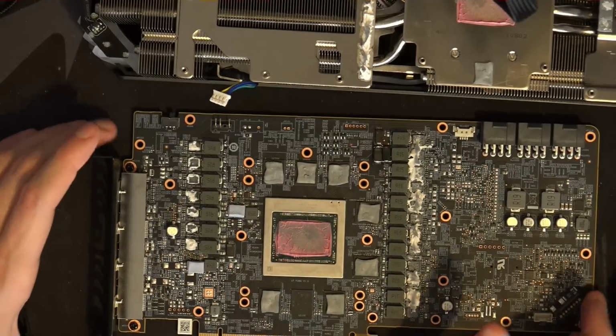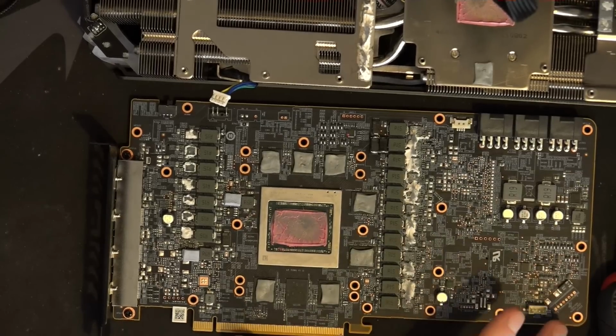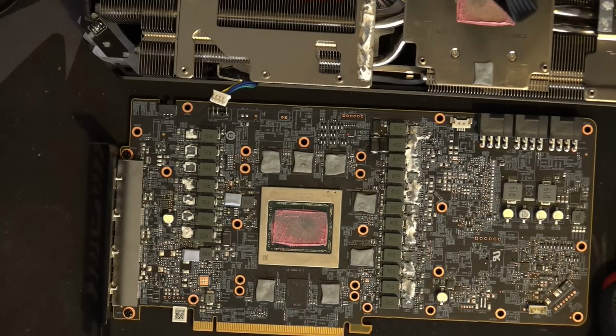Yeah, GPUs don't have power transients. GPUs don't pull different amounts of power in different parts of the frame render cycle. Especially not modern ones with their crazy advanced boost algorithms so that you can opportunistically maximize peak power consumption. Because that's the thing with a really aggressive boost algorithm: your goal is to burn as much power as you can when you really need it and then back off for the rest of the workload. And so modern GPUs are actually even worse in terms of transient loading on the input side compared to old GPUs. And it's like, yeah, we don't need input filtering capacitors.